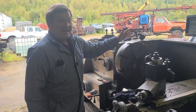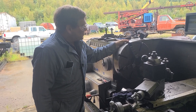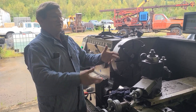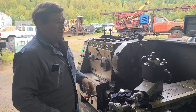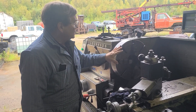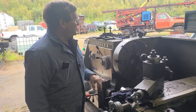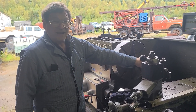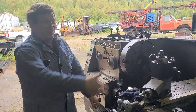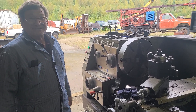I've already turned the chuck around a full turn. If I'm using a three-jaw, I'll snug it up on all three corners. Part of what that's doing is rotating it around, telling me there's nothing hitting it. Rotate this around once — very, very good. If you have odd-shaped pieces with legs or things hanging out, take a look before you turn anything on. It's not just whether it's snug in the chuck or between centers — use the other part of your brain too. I've seen somebody put something in off-balance, they happened to be in high speed, and it was a big bad thing — tears stuff up, throws pieces out, breaks the center. They thought they were going to be going 112 RPM and it was at 1,600 for some reason.